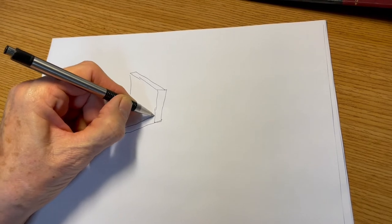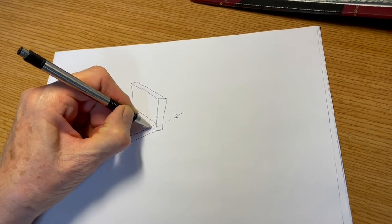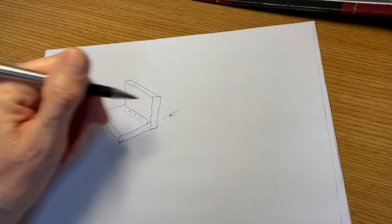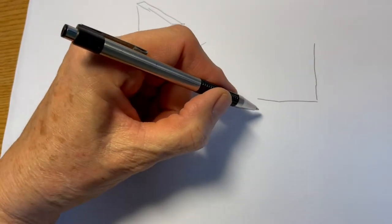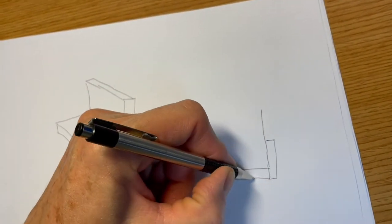I took two pieces of wood, cut to just about a couple inches from each end, going almost the whole length of the width of the stairs. So I took like a 1x4 and another 1x4, about yay long. Butted them together, glued the end, and then screwed it all in from the back. And that is my bracket. In this case, I had to make — let's say 12 steps, give or take — so about 24 brackets. But I did one bracket at a time, freshly glued and screwed. Then I would glue those onto the stairs and risers and screw them in, so all that glue was new as a whole unit on the stair.